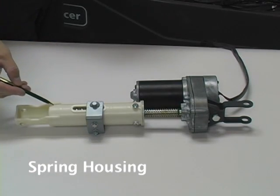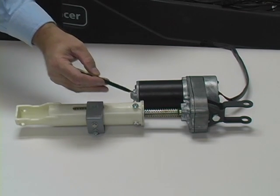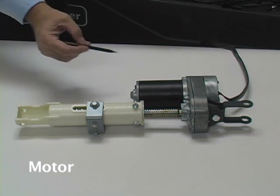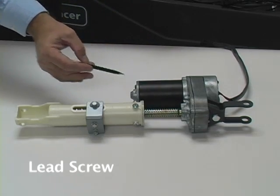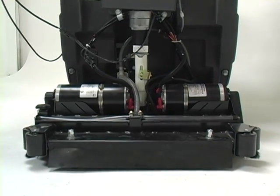The first type of actuator we'll look at uses a polymer spring housing with a two-piece steel nut retainer to hold the drive nut in the spring housing. Note that some applications of this actuator also use a top spring housing guide to help center the top spring in the guide. This type of actuator is used on several models of walk-behind scrubbers including the Convert-O-Matic and Warrior, and some rider scrubbers such as the Avenger and the Aggressor. This actuator consists of a motor and gearbox that drive a lead screw, which runs in the captive drive nut in the spring housing, moving the spring housing — and the attached piece of equipment — up and down.